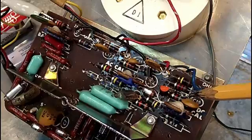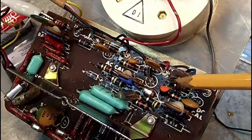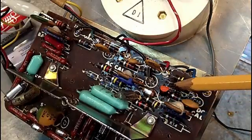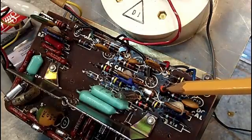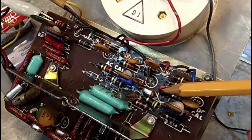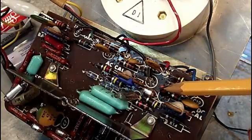And it's going to take a little while to get this apart. I have several things to undo before we can take this apart and get to the other side, so I can unsolder this. And I do have a source for this transistor. I posted on Antique Radio Forum, and the SS3672, I think is what the number is, translates to an NTE 133, according to one source anyway. So I think it's close enough to where we can get it to work.